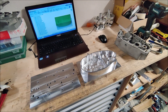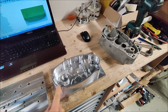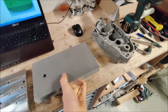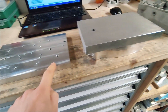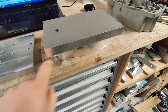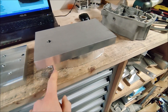It's now time to set up for op2. I will bolt this back to the fixture plate. I already cut a chamfer on this side so when it's bolted like this I still need to finish up this wall, and I can just use my end mill, back off a little bit on this surface, and then I should be able to finish it without touching the fixture plate. And then the chamfer will make sure that there is no sharp edge on that side.